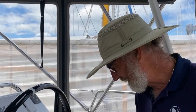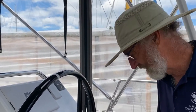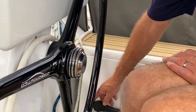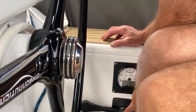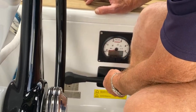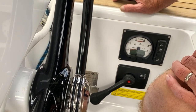Let's go over starting the engine. The engine must be running before you work the anchor windlass. To start the engine, with the throttle lever parallel to the water like that, that is the neutral position. You can tell because you can push the button in. We'll want a little bit of throttle to start with, so press that button and then drop it down. Now we have some throttle.